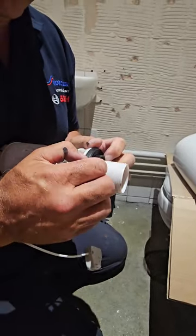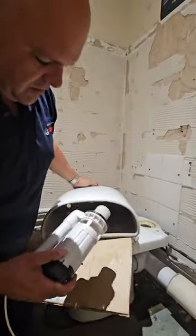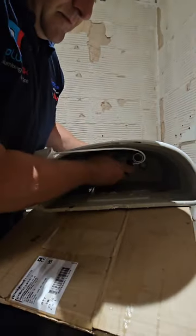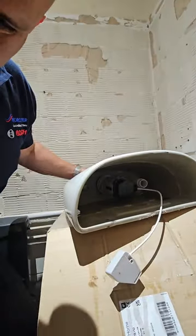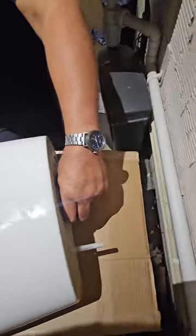Work this nice and home. Make sure this goes into the hole in the cistern, and position it to get away from the fill valve so it doesn't interfere. Sometimes you may have a close coupling kit which will sit here if those screws need to go into that — that goes on first. Tighten as much as you can by hand, then use a pair of grips. Sometimes on the inside you can see the rubber just starting to pop out a bit — my rubber is engaging. Flush valve fitted.